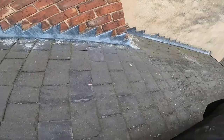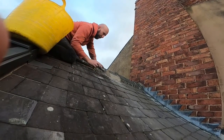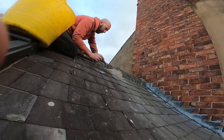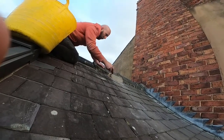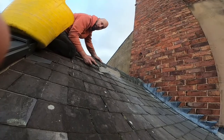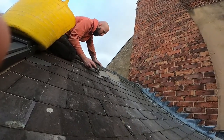I'm just going to use my brush now to give the roof a sweep. As you can see, I have changed a couple right up near the ridge, so I'm just doing a final bit of pointing now. I've made quite a nice weatherish mix — put a bit of lime in it, so hopefully it'll get that nice white colour we had originally, and hopefully it'll weather in over the winter period.